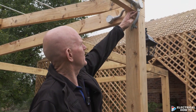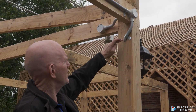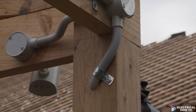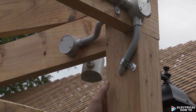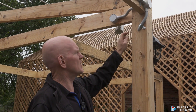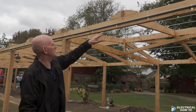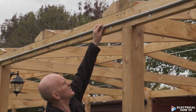Here I've done a slight set using a bending spring, then bent it all the way 90 degrees so I can cut it flush and sit it back in there — it all looks neat without filling it with silicone everywhere. We've drilled our hole from here up to the coach light on an upward angle. All the external part is in 20mm conduit, saddled all the way along because there'll be ferns and trees growing over everything here.